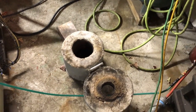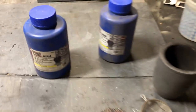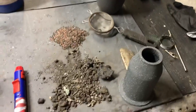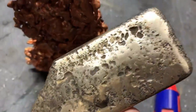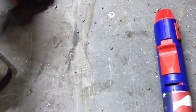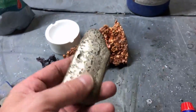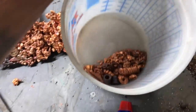I use the term 'foundry' to differentiate from a forge, because a forge typically is not used to melt metal — it's just to get it hot and beat the heck out of it with a sledgehammer. So this is the unit we're going to fire up, and we are going to melt down these two canisters of material — some partially melted e-waste with a lot of different types of metals. We're turning it into a material like this — 70% copper. I want to turn it into shot, material no bigger than the small stuff here.